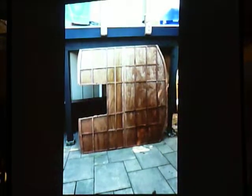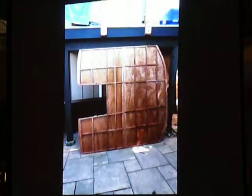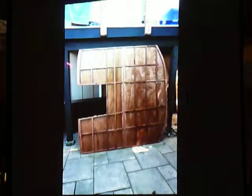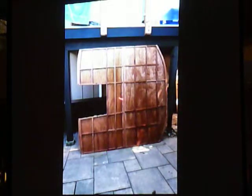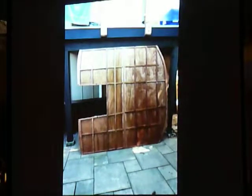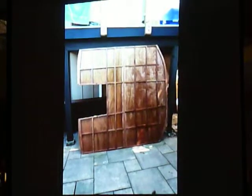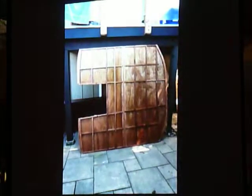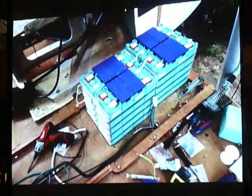Okay, so here is the plywood deck. Basically, just try to make it as light as possible. It's actually 3/8 plywood, so it's very thin, but it's marine grade, so it doesn't get wet. Right, yeah. And then the stringers, these guys sit on top of the aluminum pieces, and then this reinforcement is basically just two layers of the plywood laminated with epoxy. When you stepped on it without those, the plywood was totally flexing. With that in place, it's stiff, stiff, stiff. So it works out pretty well.